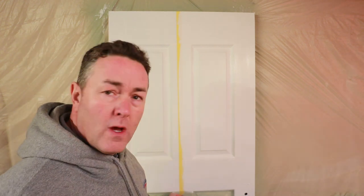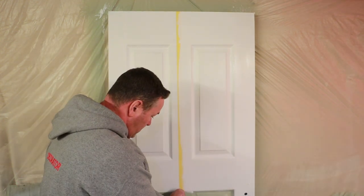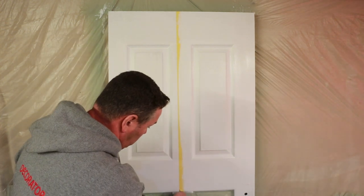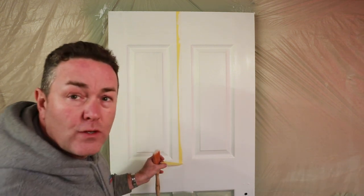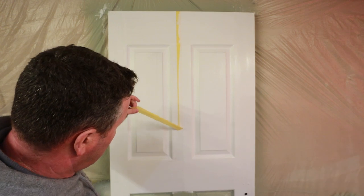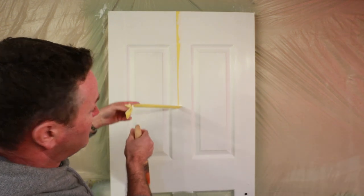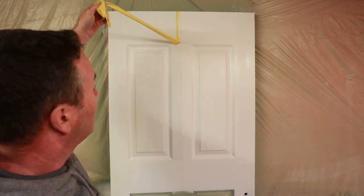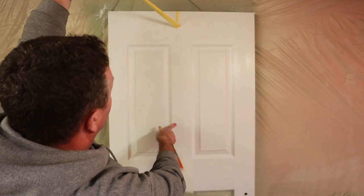All on a par - all really good paints. Would I use this again? Yeah, I think I would, to be honest. Coming back after those split seconds between the blending of these two bits of video - I've painted part of it a third coat and left the other part at two coats. This is just the low tack Q1 tape - you know, the orangey-looking one - to separate the two and three coat sections. Right, summing up.